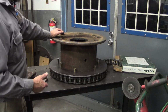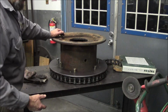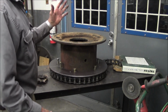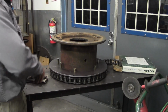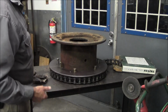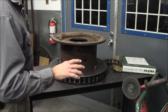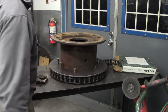I'm gonna go down there and I gotta get dimensions on it, because the next thing is coming up above this pulley here on a cross member is a pinion shaft with a throw-out cog that shifts boom raise to power takeoff on that shaft. And we're gonna be combining another flange and another sprocket to be the drive for this.